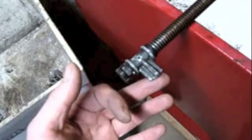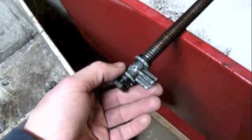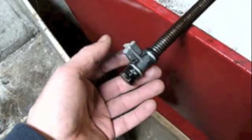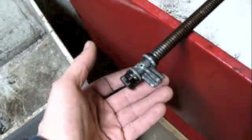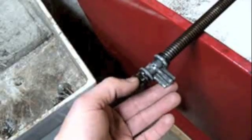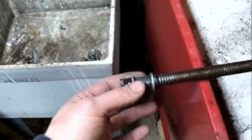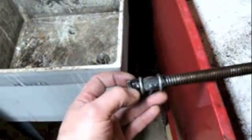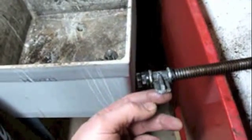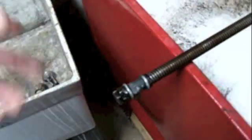The part number for this bracket is 9-16. They do occasionally pop up on eBay — I saw one that was brand new old stock and they wanted about $90 for it. A good used one will pop up for around $50, some as high as $70. They're commanding a premium because they're specialized for this particular lead screw on these 9-inch early lathes. In later models when they beefed up the lead screw, they beefed up this bracket too. There are also some aftermarket or homemade brackets floating around.